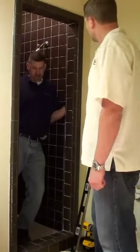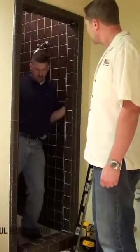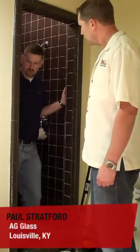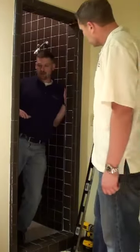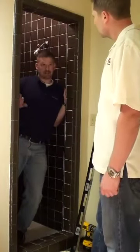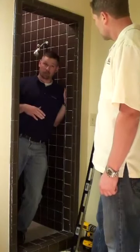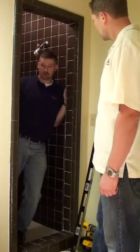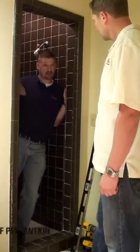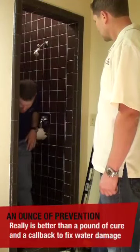We took out an older chrome frame product — it's pretty outdated. The main thing is to get that door out and get the opening as clean as possible. The best thing to do is pull the anchors out, then backfill all the holes with silicone as a precaution to prevent any water intrusion. You want to get the surface as clean as possible.